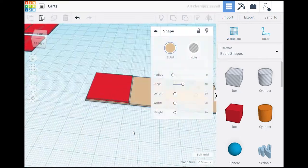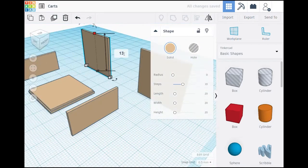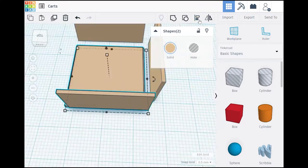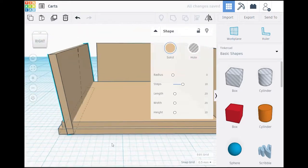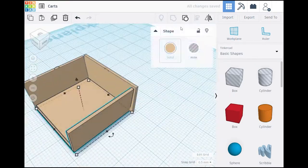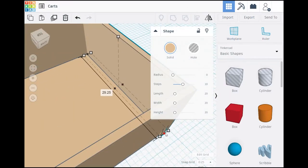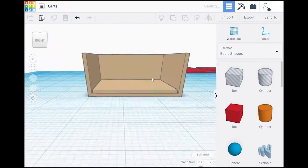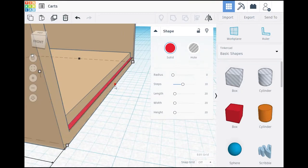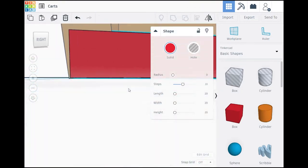It's just going to be an open cart, so I'm going to use 3 walls, and each wall I'm going to angle slightly. Oh, about 6 degrees is good. Once I get it lined up, I'm going to make sure that the bottom is completely flat with my angles, and then I'm going to cut off the excess that's overhanging from my angles on the walls.